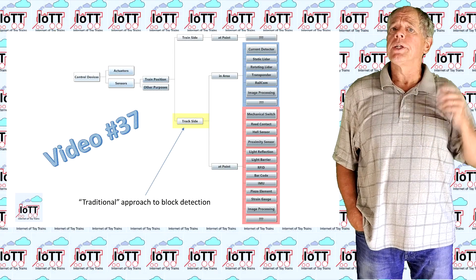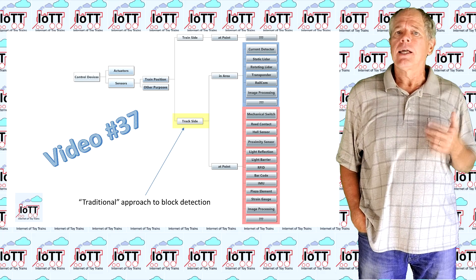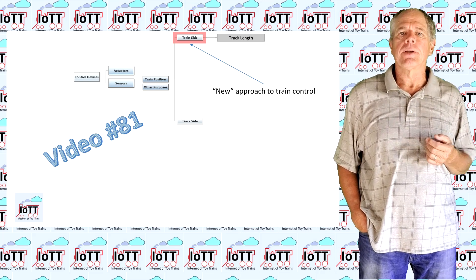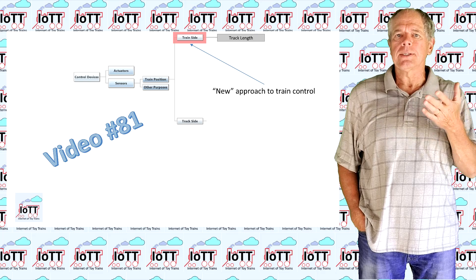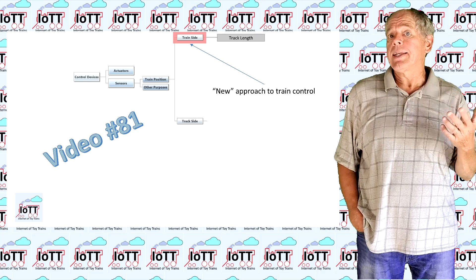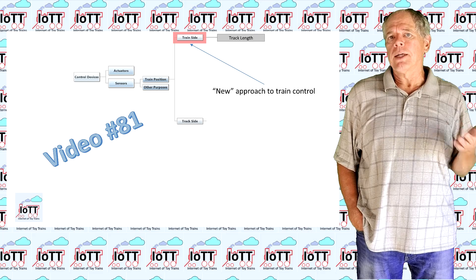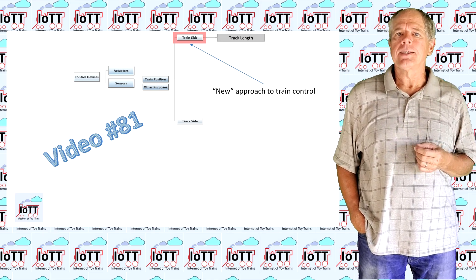So, what's new here, you may ask? Well, the most obvious difference is that instead of using track-side sensors like block detectors, I am switching to train-side sensors — namely a distance tracker and possibly an IMU to detect the travel direction. This change reduces the amount of wiring dramatically and brings the option of using signal-controlled operation down to the level of temporary layouts. And of course, it dramatically simplifies the configuration of blocks and signals, as this step can be automated to a large degree. Furthermore, it allows for more advanced and up-to-date operation concepts like moving blocks, and it gives more options for powering the trains and more.